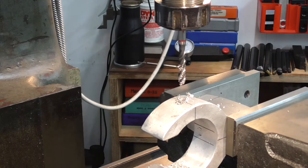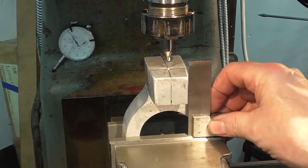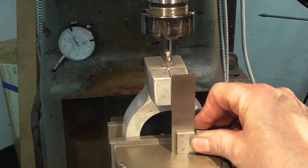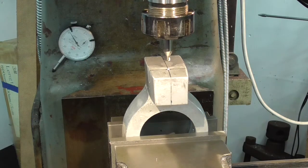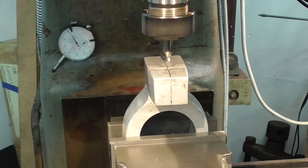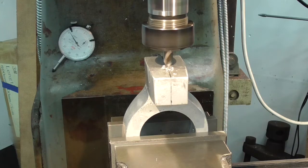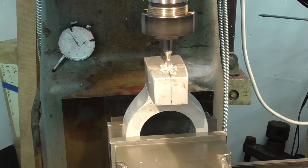And the same on the other side — I won't film that one. Now set up vertical in the vise for drilling the hole for the spindle of the dial gauge, just set up vertical there. I'll get a centre drill hole in there. I've transferred the line round, so I'm drilling from the outside. Mr. Pete drilled from the other side with a longer drill, if I remember correctly.